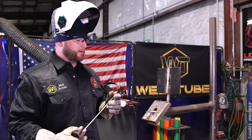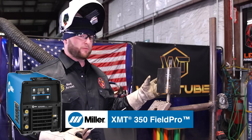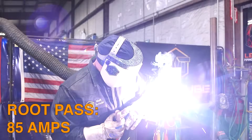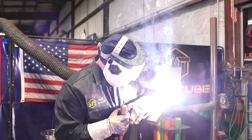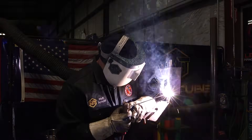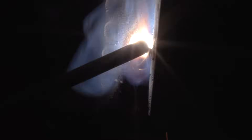For today's demo I'm using a 3/32 electrode running off the Miller XMT 350 Field Pro, 85 amps, a nice comfortable level. I tacked it over to the side so I have something to prop on and get myself nice and comfortable. You don't want to be freehanding it — just try to get comfortable, prop on something.